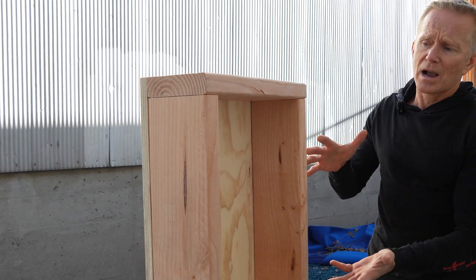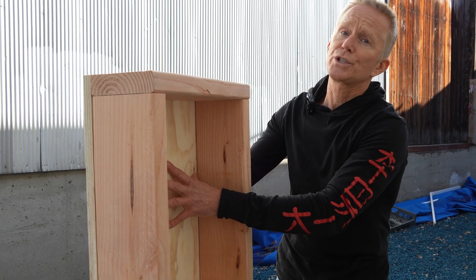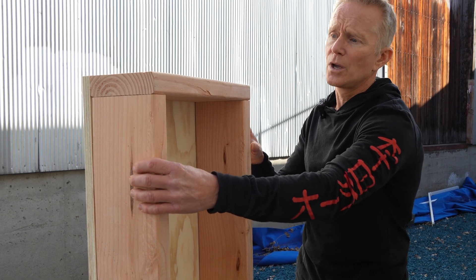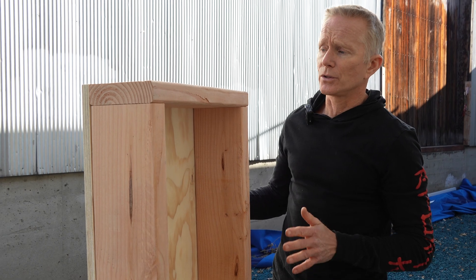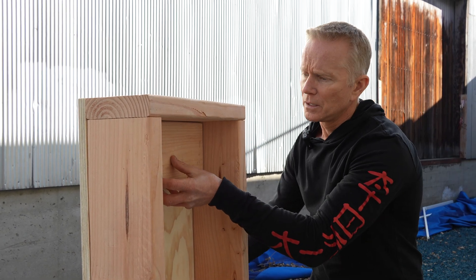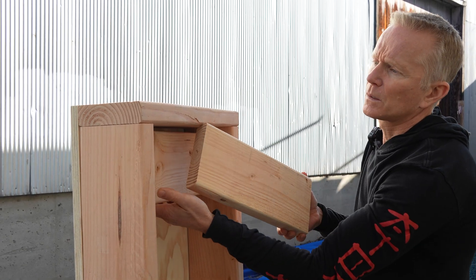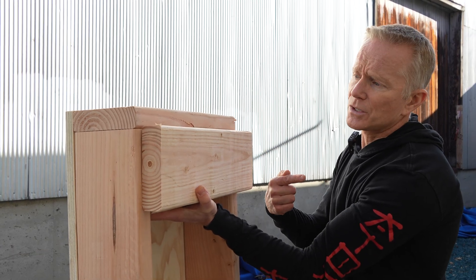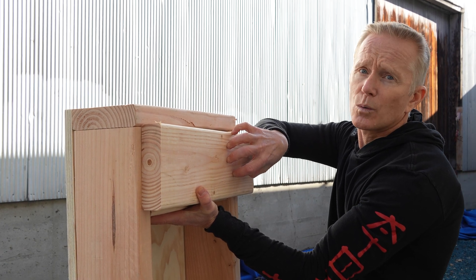This is what the back of a wall should look like. If you notice, it's just a piece of plywood here, which is not structural. Structural means the framing of the work, so that the frame can't come through the climbing wall. In the case of installing the True Mount, what we would do is install blocking behind this wall, and this will allow us to through bolt the device all the way through, so it's attached to the entire wall.